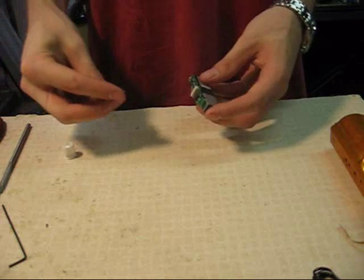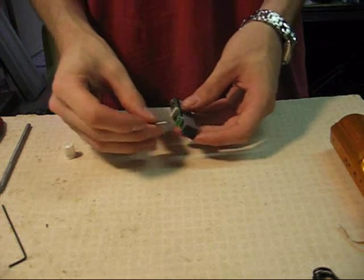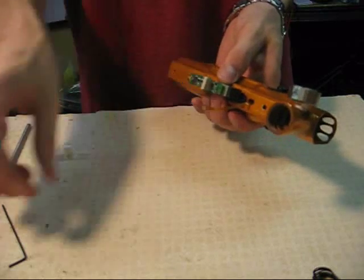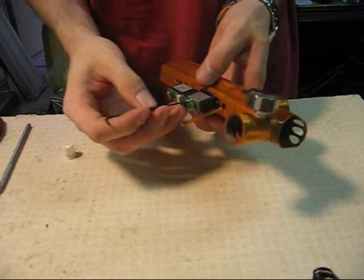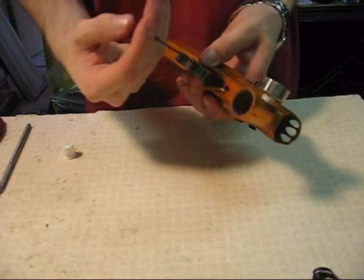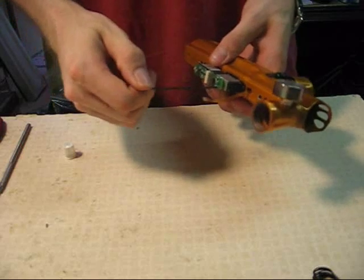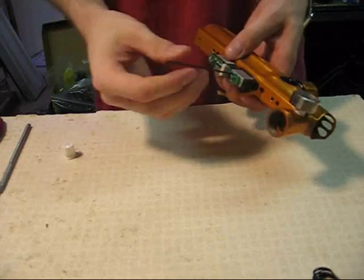You're now ready to put it back on the gun. Take the two spacer screws and insert them into their positions on the board. Take the Shocker body, align the solenoid, and when it's in position, screw the screws down. These are only to be screwed down hand-tight — you can't over-tighten them or you'll strip out the manifold, causing leaks and problems. So just hand-tight; don't over-tighten.